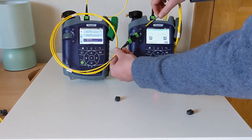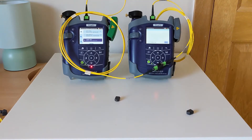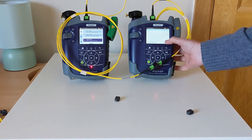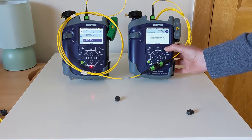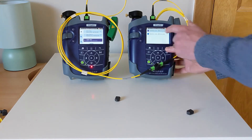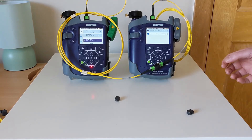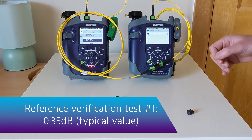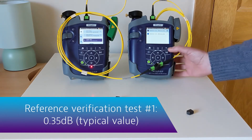Again, we're going to be listening for an audible tone to confirm they're connected. Exiting briefly, I'm going to make sure that I have chosen an appropriate test profile for this first verification step. I've made two profiles — one for this first step and one for the second step. In this case I'm wanting a loss no greater than 0.35 dB for the two TRCs.